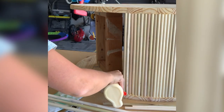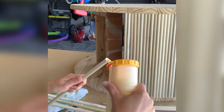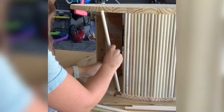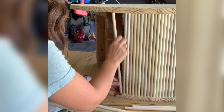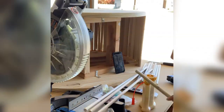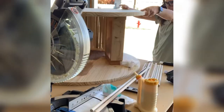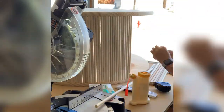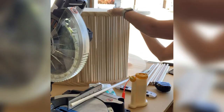Okay, back to the dowels. For every single dowel, I would dry fit it and then put a little bit of wood glue on the top, a little bit of wood glue on the bottom, and make sure it's a really snug fit so it's not going to slip out. I thought about using some type of support on the inside or a brad nailer to attach them, but trust me — if your dowels are a snug fit, they aren't going to pop out.